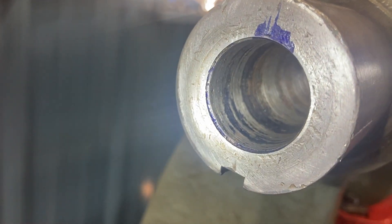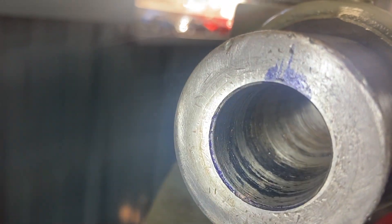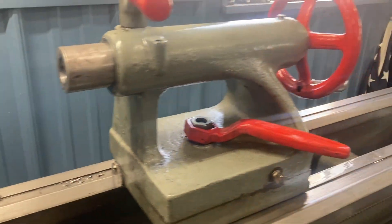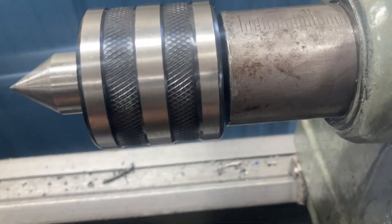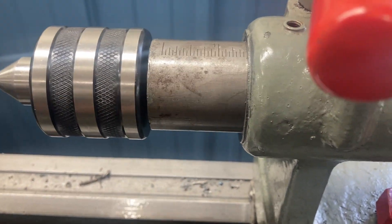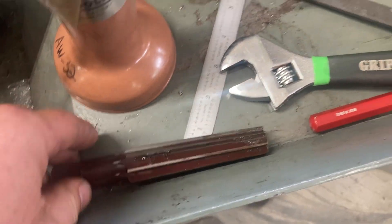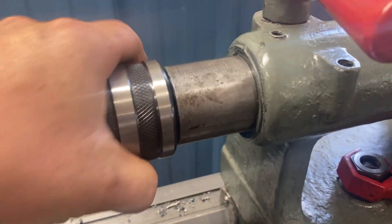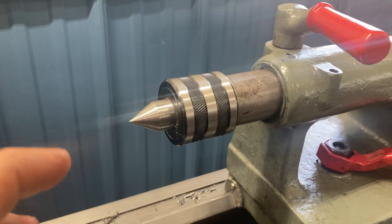Okay, I'm going to stop here because I don't want to risk taking out too much material. If you take out too much material — you can see now it's contacting in a lot of the tailstock — the problem is that if you enlarge the ID of the hole too much while you're reaming it, these tools are going to want to seat in further and further back, because the diameter here is smaller than the diameter of the reamer farther in. So take off the minimum amount. This is going to hold better than it did, though obviously not as good as a brand new tailstock. But it's going to vastly improve the amount of surface area holding on the taper.